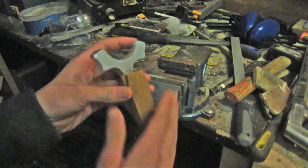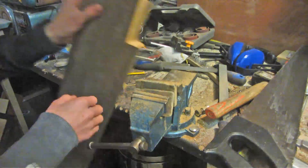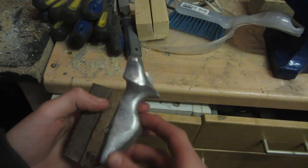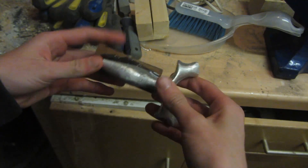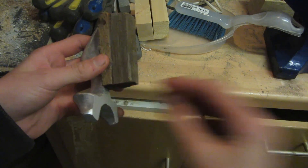Now I'm going to glue on another piece of hardwood here, but this time using wood glue since it's a wood-to-wood bond. This is the slingshot after both pieces of glue have dried, so now I'm just going to rasp and file it all into the basic outline. I'm not going to do any shaping in this direction yet because I'm going to build up some more area towards the fork over here.